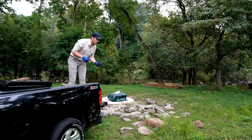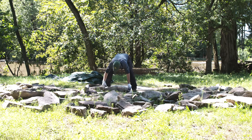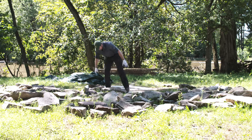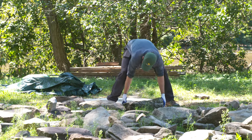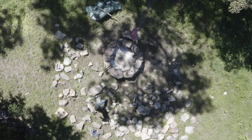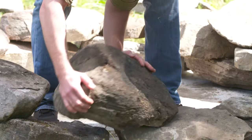A taller baker doesn't have to bend over too much, and a shorter baker can still reach in. So what we did is we found our Fieldstone — a lot more than we needed — and we meticulously, slowly chose the right rocks and stones to build a freestanding ring. Freestanding meaning there's nothing holding it together except for the weight of the stones themselves and the way that you overlap them in the proper way.